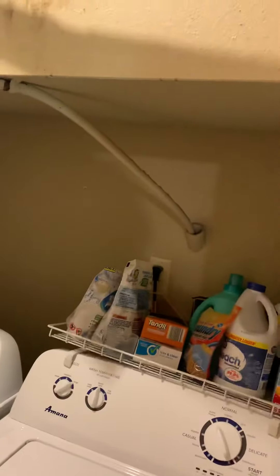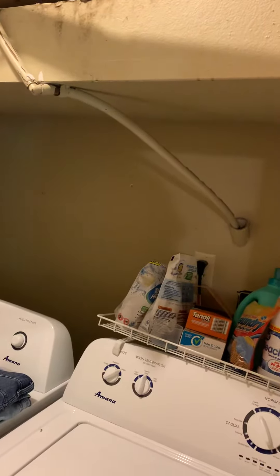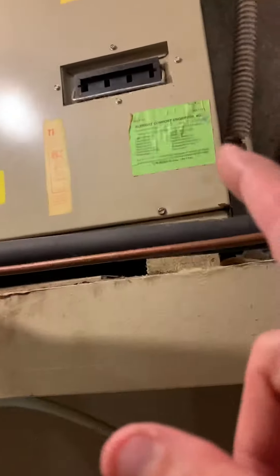We'll probably look at that smaller 39-inch long unit. For the lines, we need to cut and flush, get the new 410A in there, put new ArmaFlex on it, obviously clean up the drain. This is just a 5kW unit — it's got 8 gauge wire and it's on a 60 amp breaker, but that's always worked fine for us.